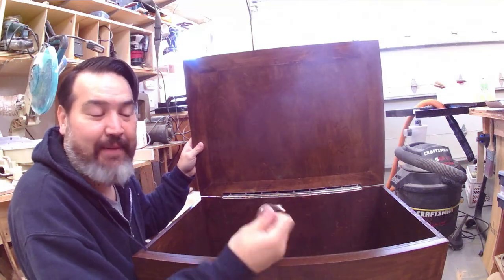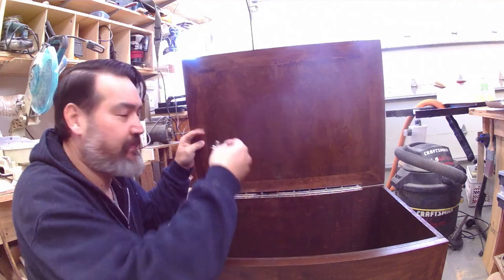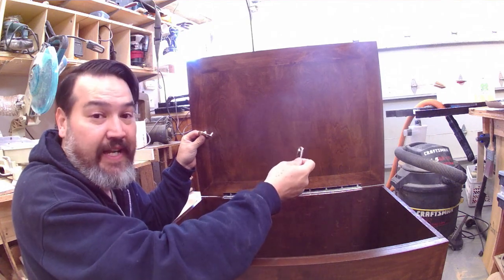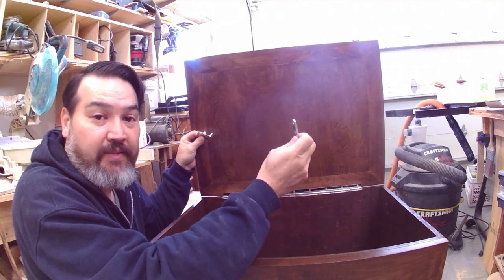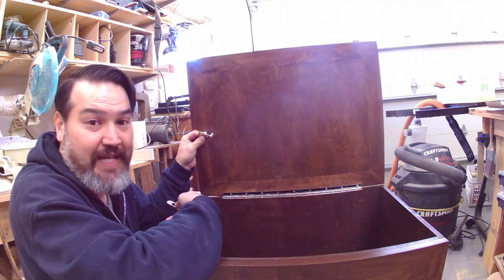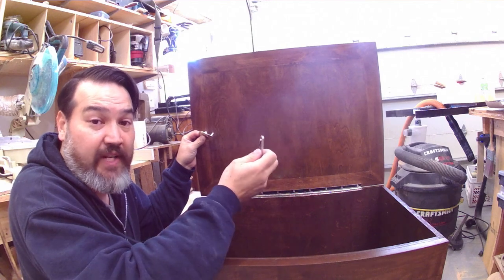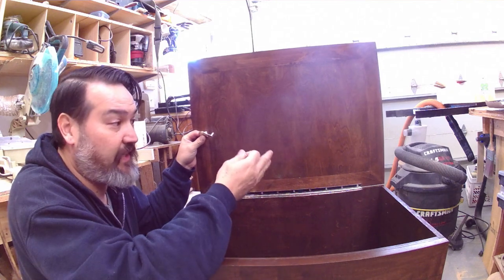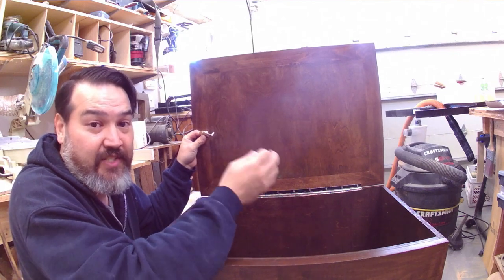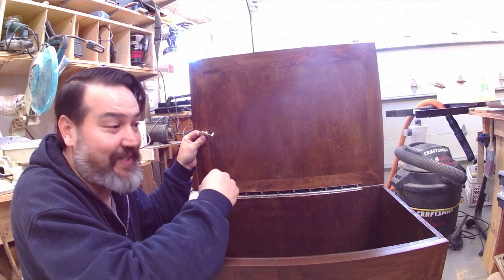So this is where all the magic happens. You've got two mounting plates — one for the hinge and one for the door. We'll mount those right now. Be careful to make sure your screws aren't longer than the wood you used. The box construction was half inch so I needed to use smaller screws than what came with it, and the top lid is three quarters so the included screws were okay. Always be aware of what screws you're using for the material.